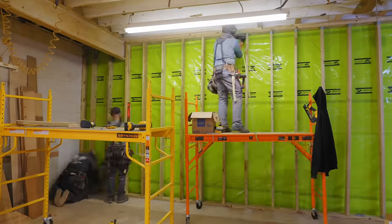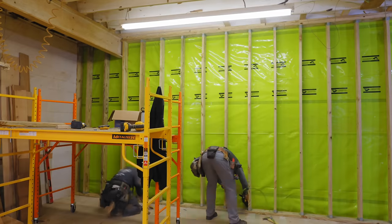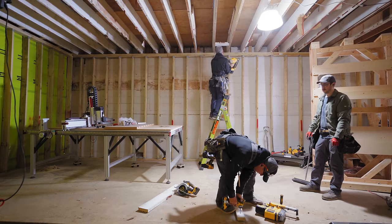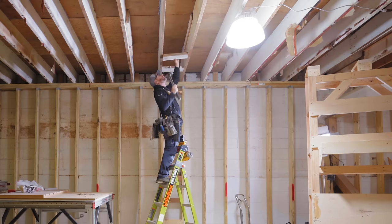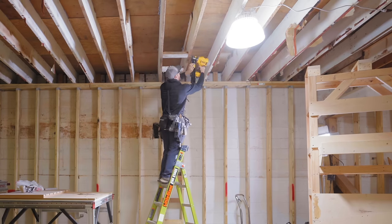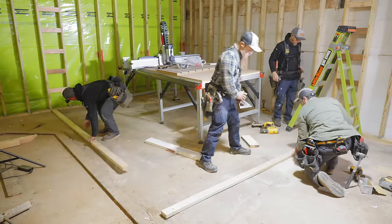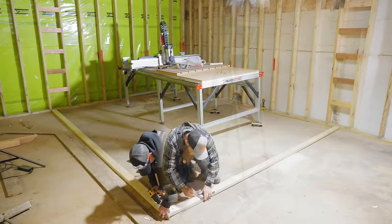The guys got the rest of the back wall wrapped up, and with that the exterior wall framing was done. While Jason got the bottom plate installed, Eric started measuring for blocking — needed since the top plate landed between two floor joists — and we were able to use up a lot of material we'd demoed from the attic space, avoiding sending it to the landfill. We snapped a line for the second bottom plate and got that installed while Eric and Ray started laying out the door opening on the other wall.